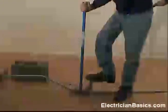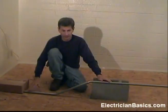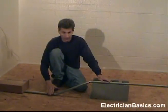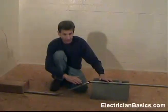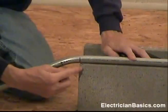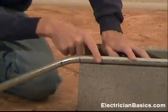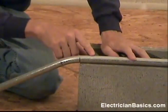Okay, that's where I want to be, so it's time to check how we did. We've made our bend and put our pipe in place — let's look at how well it fits. We're at our fixed obstacle here, running flat on our original elevation, then coming up on our offset at our new elevation. The first mark is just a little bit lower than the height of our obstacle, but the second mark, in which we allowed for shrinkage, puts us right at our proper elevation. This is an example where shrinkage entered into the picture and was very important in making this calculation properly.